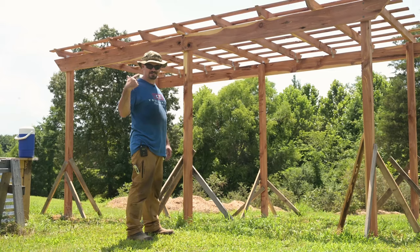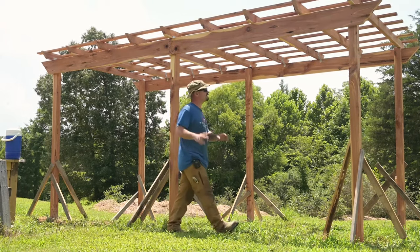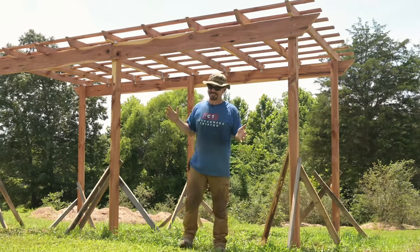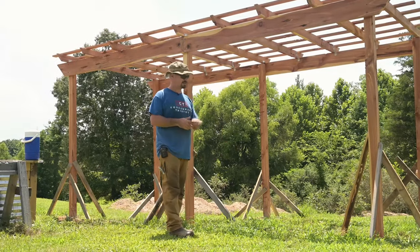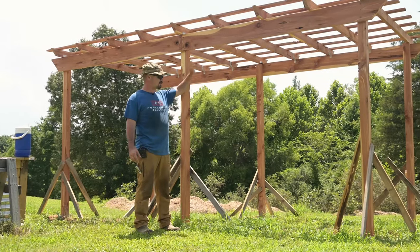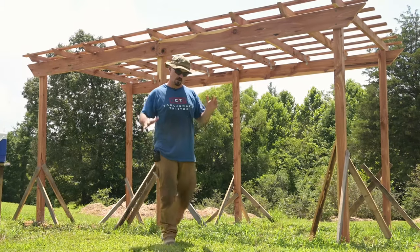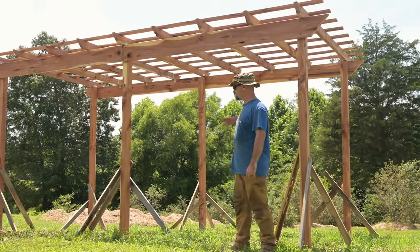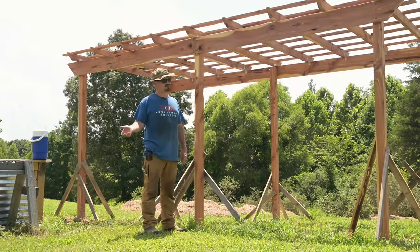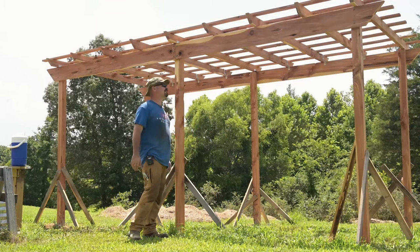It's done, and I'm hot. I ended up adding some concrete to the posts because it wasn't quite as stable as I wanted. I do have a few cedar logs left — I might get two more 2x8s milled so I can add a piece on the long ends, which would really add rigidity to the structure without the concrete. But the concrete should get me there, and I might add those pieces later. Once the concrete's done I'll knock off the stakes. Otherwise she's pretty much done. This is going to be a trellis — I'm probably going to plant some honeysuckle, have it come over, and be a nice little shady spot. Where the camera is right now is going to be our pool area, hopefully next year. We have the garden and orchard behind us, so this will be a nice sitting spot. It's really cool to have made this from lumber from the property that was rotting and on its way out — just going to become a hazard — and we were able to catch it and turn it from a hazard into a feature. That really makes me happy.